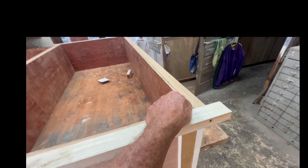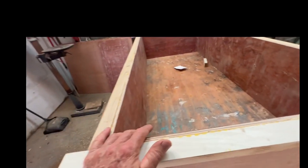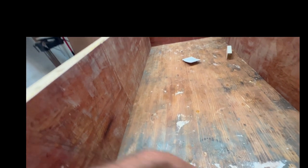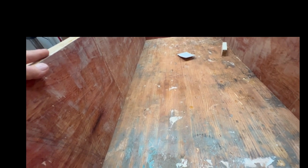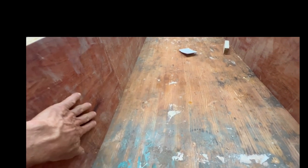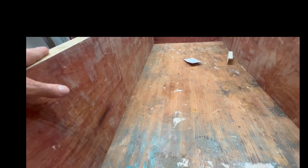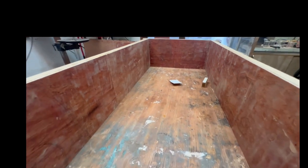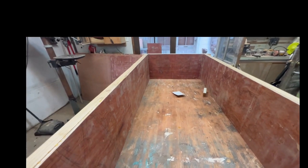We have a top — this is going to get a radius. I've got the insides and the corners braced. I'm gonna turn it over and run inch-and-a-half ledger all the way around and some in the middle. That will bring the bottom up inch-and-a-half plus three-eighths — 1 and 7/8 inches. Since this is 12, that'll make it more or less 10, which is what I was shooting for. Within the top it's going to be like 10 and a half, but that's close enough.